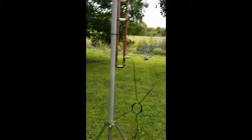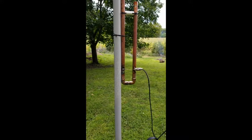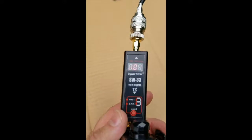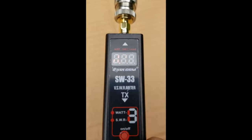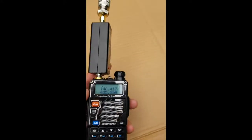Final part — I don't think I will be able to get up on the roof today, so there will be a part two. But I want to try and get the other end on so I can test this out before I wrap it up for today. We have the antenna all hooked up now. I soldered this on — this should work. I got 1.02 now for the SWR on 146. And then if I go to 435.000 and do the same test, I get 1.3, which is absolutely great and within the range. So we have a working antenna.